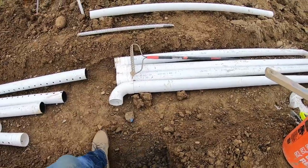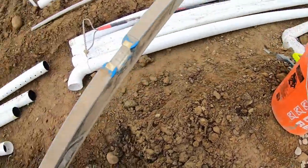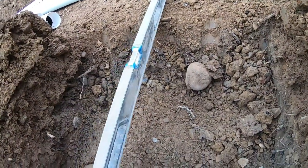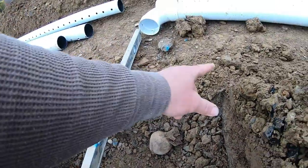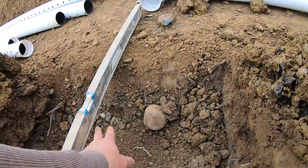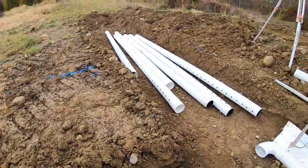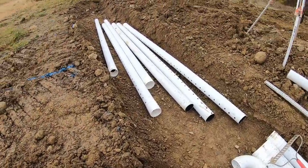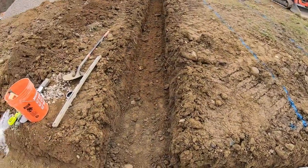So if your trunk is dead money, I just take my level, come across, I measure six, and that's what I set my laser to. You know what I mean? Just level that off your bank, because you already got that at your correct height. Six there, run the laser all the way. Just a quick pro tip on how to get that notch right there. I didn't explain that before, just want to make it clear.